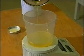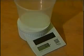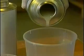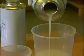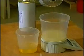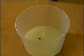There is a great variety of PU two-component casting resins available for part production, which can perfectly imitate virtually all thermoplastic materials like polypropylene, polyethylene, polycarbonate, and ABS. The two components of these PU casting resins must now be weighed and pre-degassed. If necessary, the resins can be colored using the MK color kit.